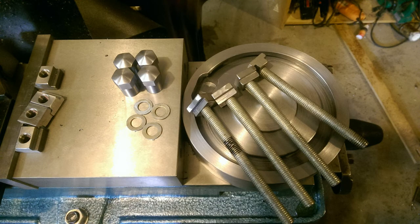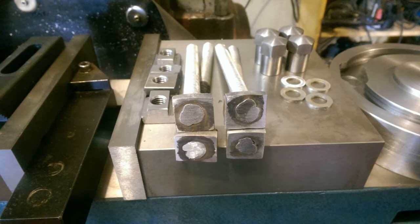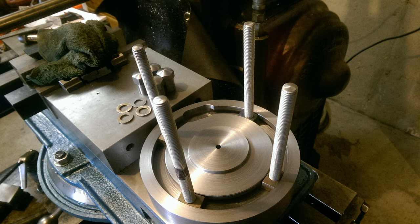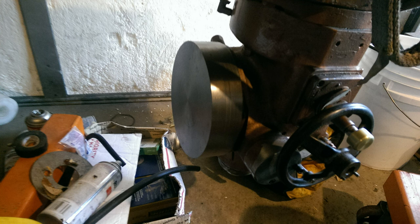Here are some photographs of the finished product: the T-nuts, the bolts, the washers, and then I took some half-thirteen threaded rod, threaded them into the T-nuts, welded them in, and ground off the welds. Here it is mounted in the head mount, and here are a couple of photos of the head hanging from the engine hoist showing the bolt heads and the back side. There's the mount fitted up and ready to go. In part three we'll look at making the next part that allows the head to nod front to back — I didn't know if I needed that feature but decided I did, and it turned into a lot of work.